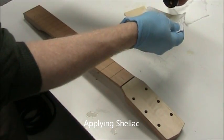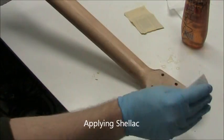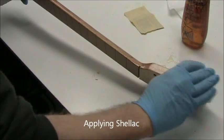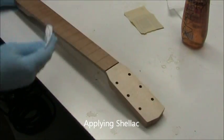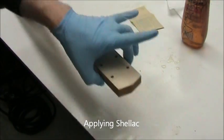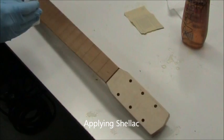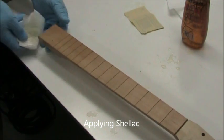About a tablespoon or a teaspoon at a time. You want enough that the surface is fully wetted so the shellac is fully in contact with the wood — there's no dry spots. But we don't want to put on so much that we create runs or drips or sags, because those look pretty horrible and they're very hard to get out after they're dry.